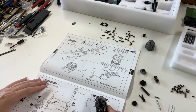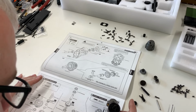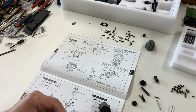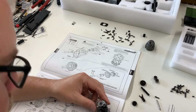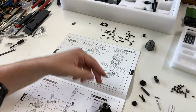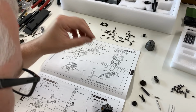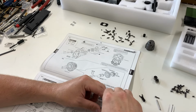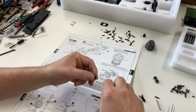Next up, it doesn't really have a specific way this goes. Doesn't look like any way. So there's a bearing holder, which goes right here. It goes only one way. It's got a little set piece there, and it's made into this piece here. Boom. Good there. So a half-mil spacer goes on that. Then the 20 tooth gear, which is the other big one. Then your output shaft, which just slips over that. It goes into the bearing here. Pretty simple there. And 2 bearings go over that.